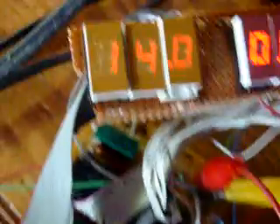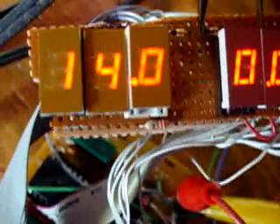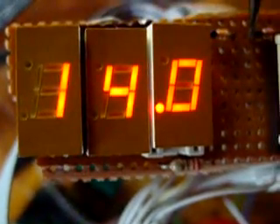There's the bezel, and there are the bare meters. One of them is a lot dimmer than the other on the displays. So what I'm going to do is short out two of these diodes. You can see it makes the brightness more equal to the other displays — see the difference. It barely shows when I do this, but then it comes to life more.